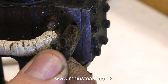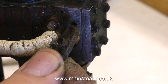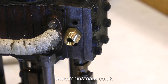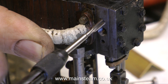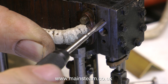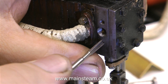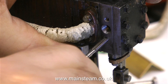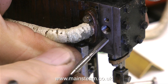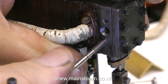In this clip I'm having a quick look at what's left of the manifold, and I'm going to put that in the bin. I could just use my threaded union and plug up the holes in the steam chest, but that wouldn't look good. The problem is these holes in the steam chest are of a strange size — they look like 5BA but they're not. The bolts that were originally in there were 6BA and they were a rattle fit. So I'm going to re-thread the holes 5BA.